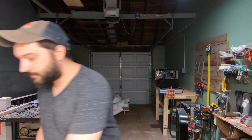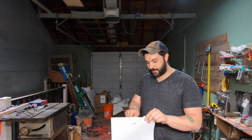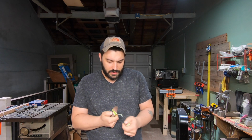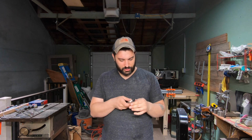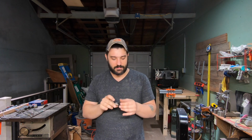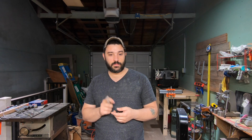So, with that said, this is where we're at with that edge. I left it taped so we can mark it. I mean, that edge is pretty, if you all want to agree, fairly toasted. So, we'll remove the tape and we'll do a little edge testing with the brass and the Bacote, and we'll really get in there and try to see if we can get some deformation and stuff like that. Like I said, I pressed down on this and we got some ductile feedback. It's pretty bendy. When I broke that knife, that was after the first temper. I was at a good 75 to 80 degrees before that snap, so that gives you an idea.